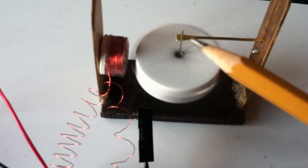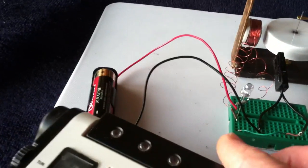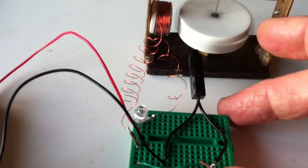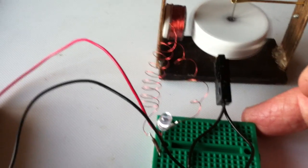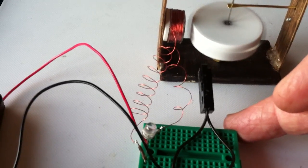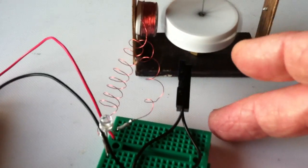When you get a stable platform like this where you're secured at the top and secured at the bottom, it gives you a lot more flexibility with these little needle motors. I'm going to rev this up by moving the timing — what I'm doing is putting the timing where it needs to be. If you go too fast on these little needle motors you're going to throw a magnet the way I had these glued on here, so you really don't want to rev them up too fast. For most experiments you don't need super high RPM, just enough to do your experiments.